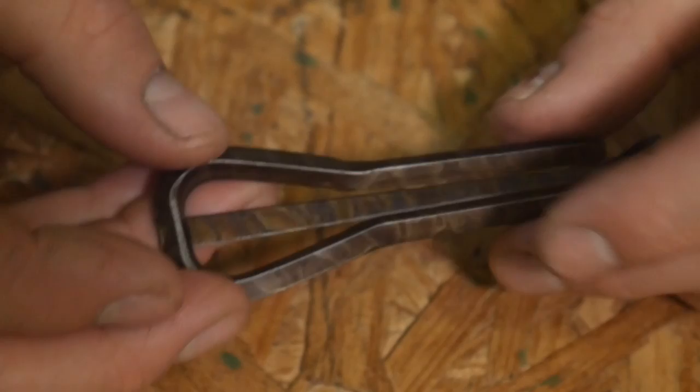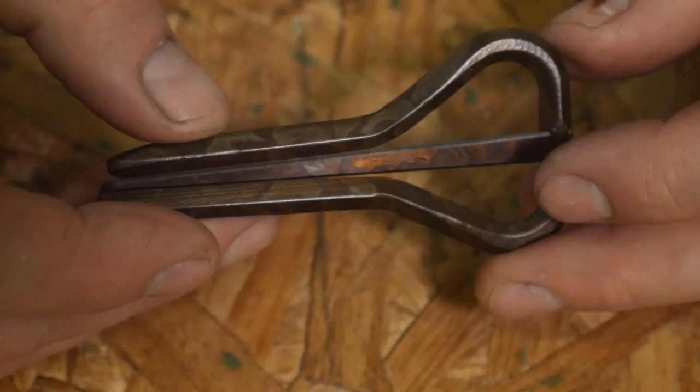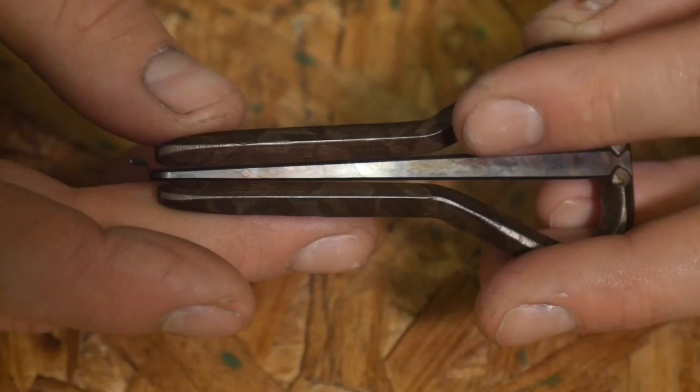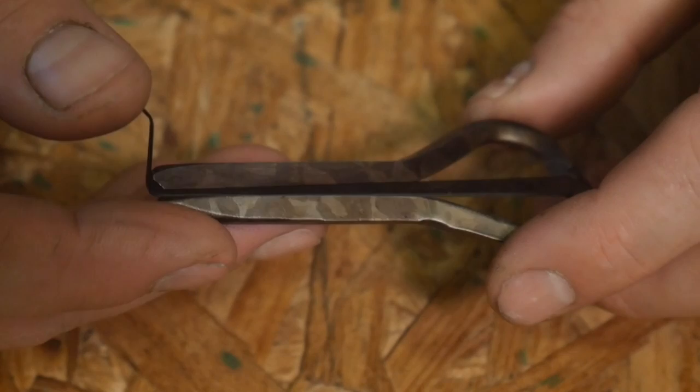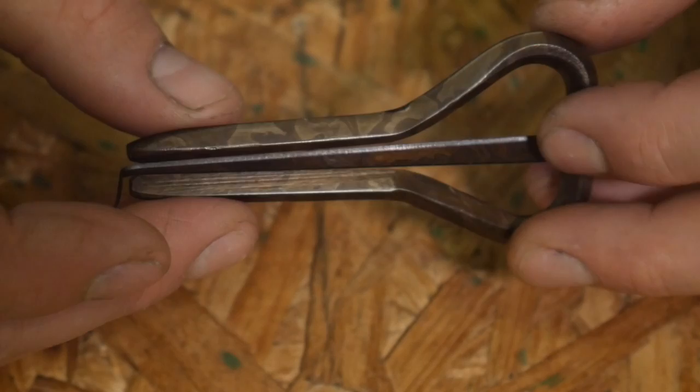I built another harp yesterday. Here's that other harp. This is my take on a Maultrommel or Austrian or German style. I went ahead and I ground both the back sides so that the harp is flattened where your fingers and where your thumb go. Here we have another bent trigger for Jerry. This one I made at a .020 blue tempered spring steel, so it's a little bit whippier of a reed. And it's a little bit shorter of a harp. Single ground, I went ahead and faced the single grind forward on it. I put the crimp on the front.